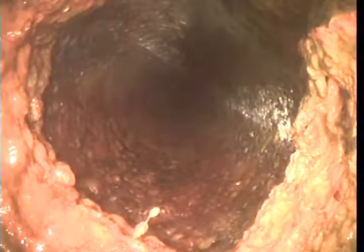Turn, another turn. Wow. Okay, yeah, we gotta clean all that up. It's pretty bad. Okay, this is gonna be the end of the line right here. It transitions into the smaller branch line, which is 2-inch cast iron at 34 feet 1 inch. I'm going to go ahead and pull back, end the inspection, and what I'll do is I'll go back in after I end the video recording. I'll go back in and locate where these problem areas are and get a proper quote. Also where those 45-degree turns are.